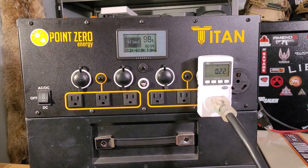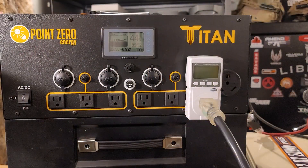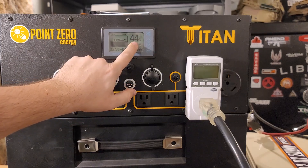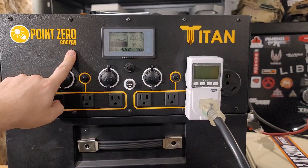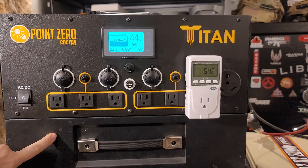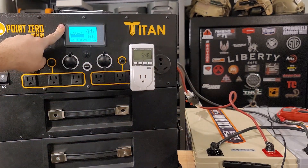The test is going. It says we're going to run for six hours at this load. I'm using a time-lapse timer to see when this whole thing ends at zero percent — that'll be quite impressive if it can do that. It just shut off and the fans are still blowing but not blowing hot. It looks like it used close to 100% of the Titan battery capacity but not the expansion batteries — it says it used 5.46 kilowatt hours, which would be 91% efficiency, but it clearly did not use the entire battery capacity.